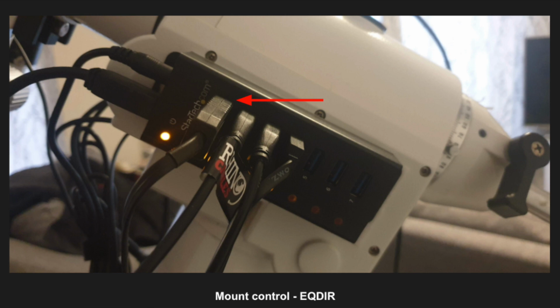Moving down, the first actual USB cable in there is the EQDIR cable. This is a special USB cable with a special instruction chip, or microchip, in it. And this is what controls your mount. What the chip does is it interprets the instructions from the laptop and sends them to the mount. And likewise, if anything needs to come from the electronic boards in the mount back to the laptop, this cable does that for you. So it is a special USB cable. It's not just a standard USB cable. And I'll put links to examples of this underneath this video in the description.